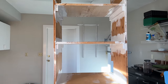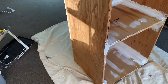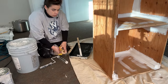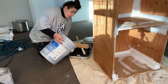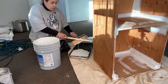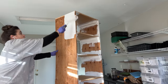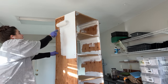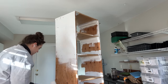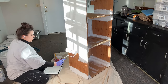I've gotten all the corners painted, so now we can get the roller out and save a ton of time. I'm going to start at the top and work my way down just to manage drips. I can already tell I'm definitely going to need two coats, which makes sense because this plywood is not primed at all. But that does look a lot better already. To get this done we end up using three different days where we've got little pockets of time here and there.